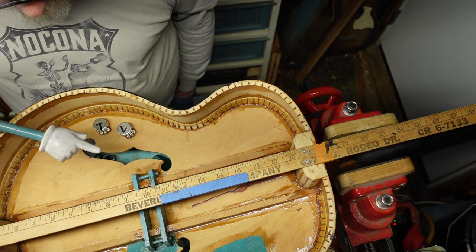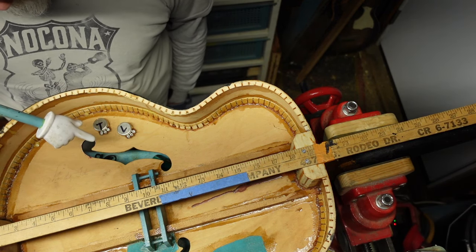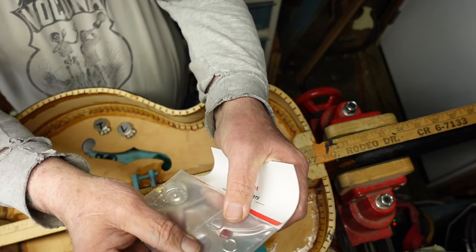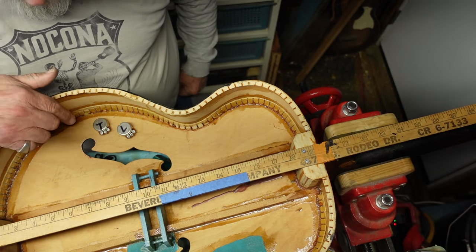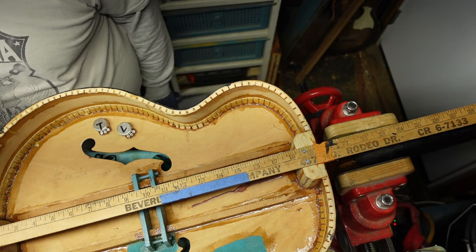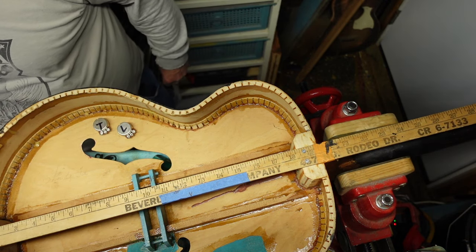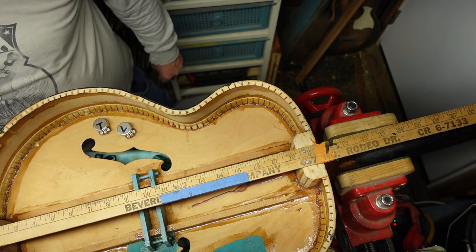So there's also on the tone pot a capacitor, a resistor, whatever you want to call it. It's one of these little red things right there. You see that in there? That goes to ground and to one of the lugs. And also the pickup or the input jack feeds from here also to the tone pot. So let's get the soldering iron warmed up and get to work here.